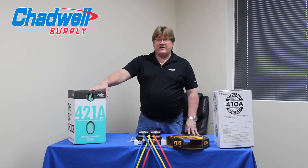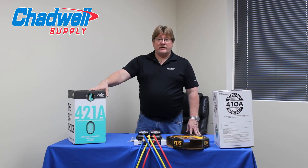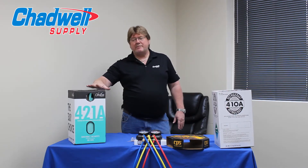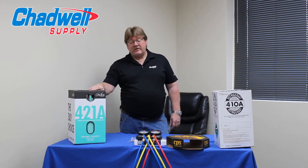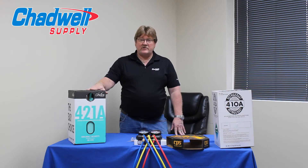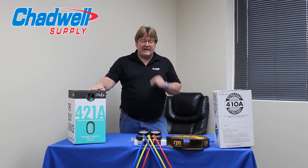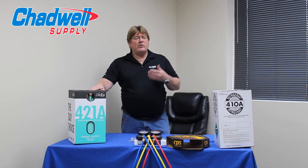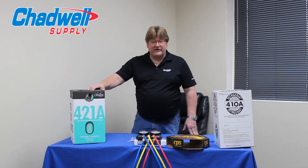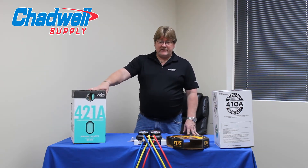That 0.3-degree fractionation value is so small we don't even have thermometers that will really measure it. Not only that, the pressure-temperature relationship to achieve a 40-degree evaporator is exactly the same as R22 — no discernible difference you would be able to read on your gauge. Basically, if I painted this jug and wrote R22 on it, you probably would not be able to tell the difference.